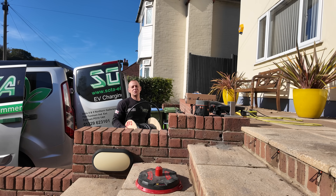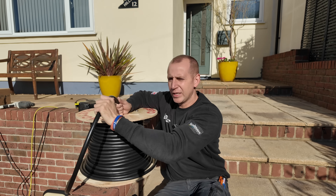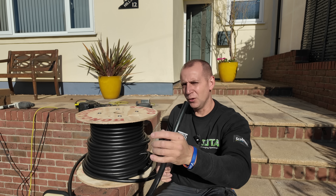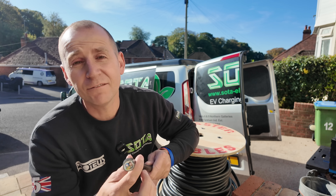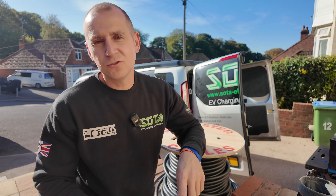The cable I use is Doncaster Cables EV Ultra. The thing with this cable is it's manufactured in the UK to the highest standards, and inside it we do have a Cat5. This version has four pairs, which means I can use one pair for the CT which I need on this install, and it leaves three other pairs which can be used for an ethernet or Wi-Fi connection — can't do it with this charger, but it also leaves those other pairs free for solar and battery CTs if required. Far better than running a separate Cat5 all the way back. Also, there are a lot of other cables on the market that call themselves EV Ultra — if it's not Doncaster Cables, it's not EV Ultra.